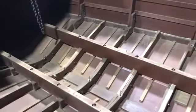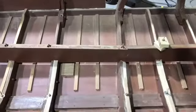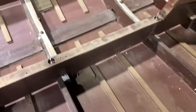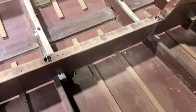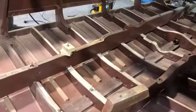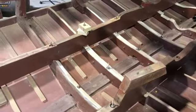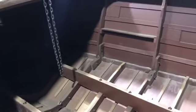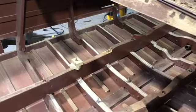Here's a shot of the 5200 floor that we've spent the last 12 months on — it's got all new ply liner, all new battens, and you can see the tops of the new oak frames running through the back end of the boat. It's pretty dirty and dusty in there but it'll clean up and paint up fine. It's a bit messy up the front with all the adhesives, but we're really pleased with how that came up.